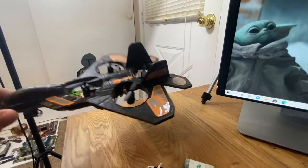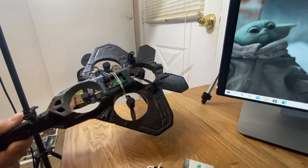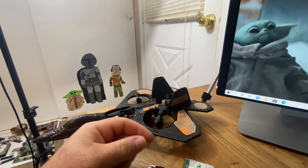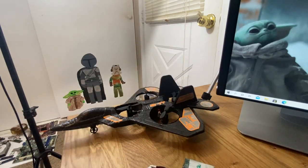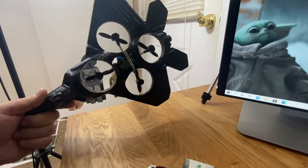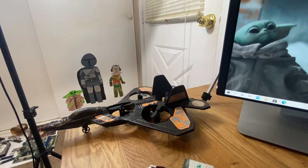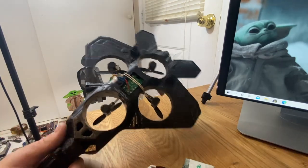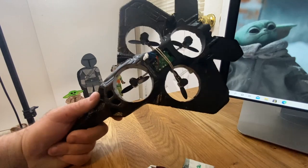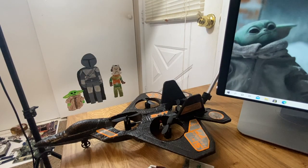There you have it guys — very nice and simple. The connector is nice and tight. If you have JST don't be afraid to go with whatever batteries you have. Don't throw on a two cell battery — a lot of boards typically cannot handle that. You may be lucky with the high voltage HV batteries — it just depends on the board and how it was made. The little capacitors, resistors, and chips can only handle certain voltages. Sometimes you get lucky with the components they bought, like with the boat — it can handle a little better voltage but it does get a little warm.